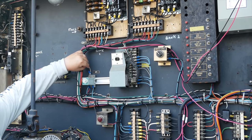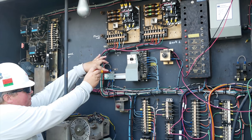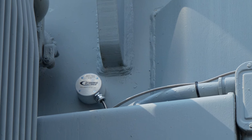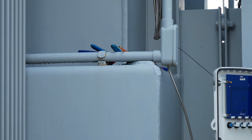Repeat this for all terminations inside the control cabinet. Once installing the magnetic mount RTD, keep it as close to the same height as existing temperature wells. Pull the stainless steel jacketed cable down, zip tying it as you go and coiling excess up, then terminating the wires inside the B100.